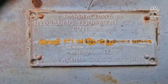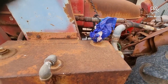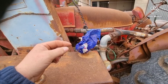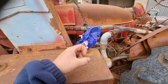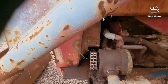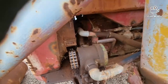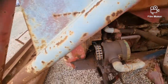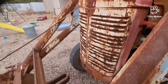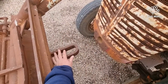I should put some oil in it too while I think of it, and have a bit of a fish around. I've got a breather that was corked with a nut in it to let air in and out, but obviously there's been a significant pressure change that sucked the cork in, and the cork's probably shrunk. It's chain driven off the front, but you can still actually crank it - hand start it - there's my crank handle. I did used to use that except I'd leave the bucket up in the air. You've got to stand under it but you're generally just pulled from one side. I'm thinking about cutting that off.